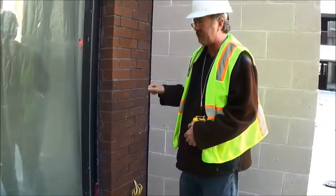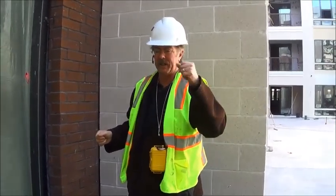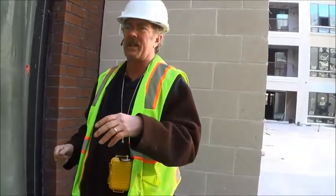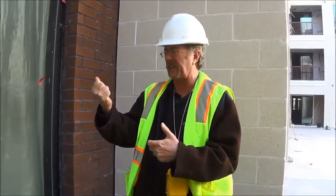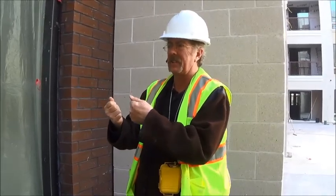If it gets too tricky, take a quick trigger torch. Your Home Depot here has something called a quick trigger torch. Do you have Lowe's here? Yeah. Lowe's has one too. It's a little better. It's called the TS-8000. It's a quick trigger torch that uses MAPP gas or propylene gas instead of propane. Much hotter. The torch is a little bigger. And what you do is you take an HB knife, which Lowe's and Home Depot have. That's the thicker razor knife with a 4-inch blade on it. Torch it until it gets red hot.